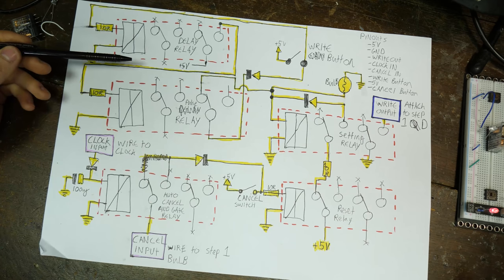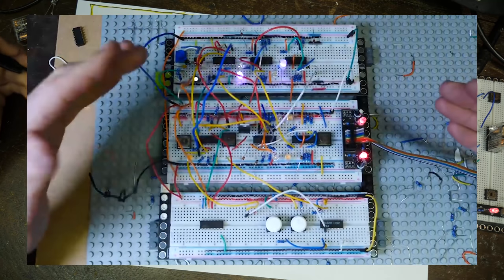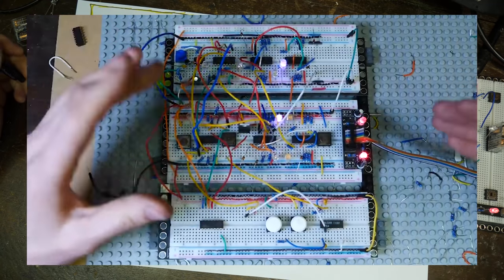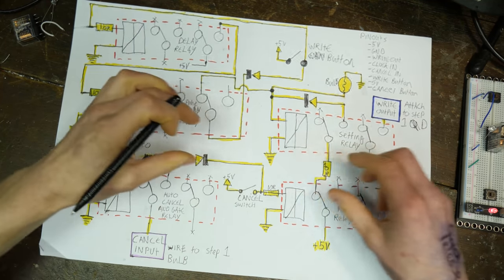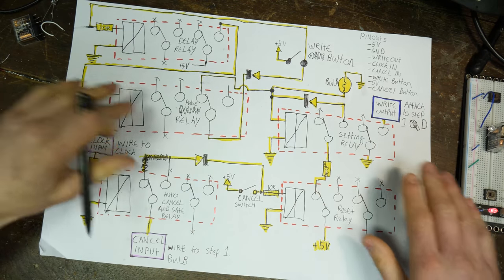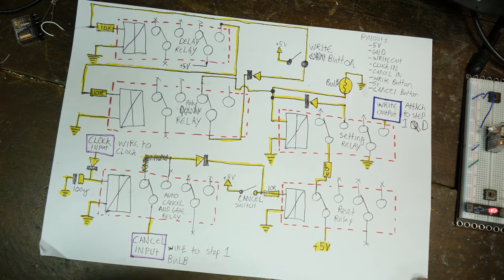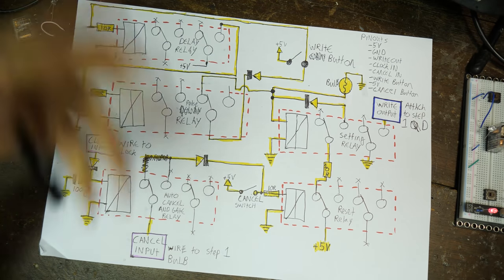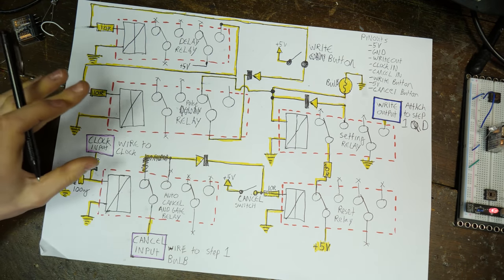This is another part to the step sequencer that is similar to the circuit that I made, but with digital logic circuits, over on the Museum of Everything Else YouTube channel sequencer video, which is touching on the 4013 chip doing this, but with chips instead of relays. This circuit means that I can write a single bit into the step when it starts, so it doesn't ever play more than one. And this actually makes the most of other fundamentals of relays.